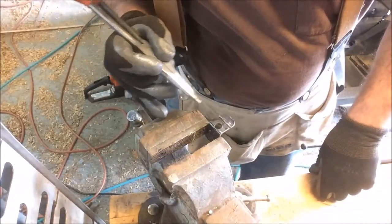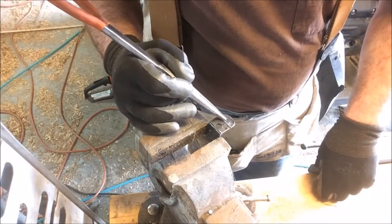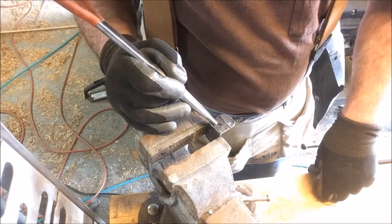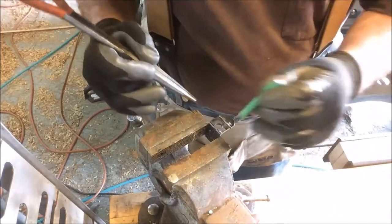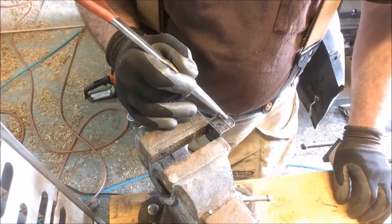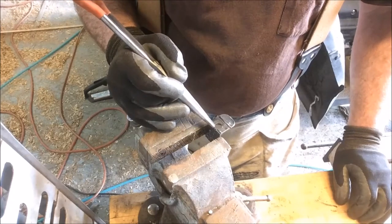You're probably wondering why I rounded off these edges here - it's because I changed my mind halfway into the project. I was going to have the hole for the through-bolt right here, but I thought I'd have it closer to the door. When I run the through-bolt in there, it's going to be closer - there's going to be more engagement into the jamb. If I have it clear out here, I might stand the possibility of missing the jamb and the strike plate. So I moved it as close as I could.